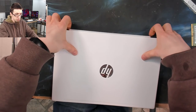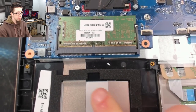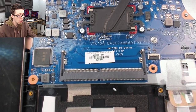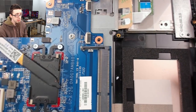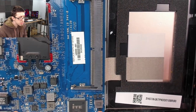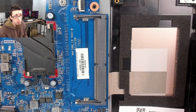So BIOS was not the answer. The next thing I'm going to try — and I haven't attempted this before — is that the connections along the back of the memory connector are classics for becoming damaged. So I'm going to try re-flowing these connections. I've heard from people in the know that it is a thing that can happen. There are no visual problems with them as far as I can see, but they are vulnerable to just pulling up off the board from bend stresses. There might be a bad connection we just can't see with the naked eye — maybe a microscope could see it.